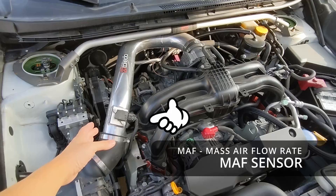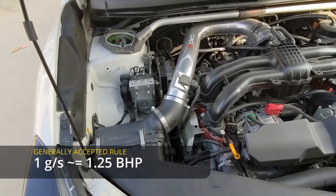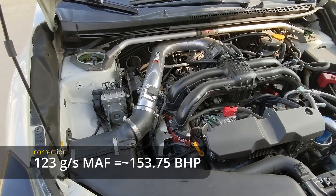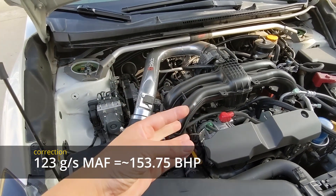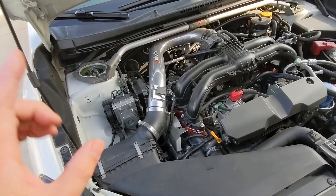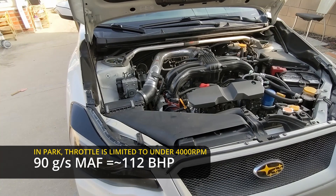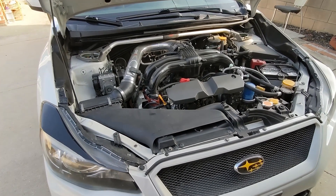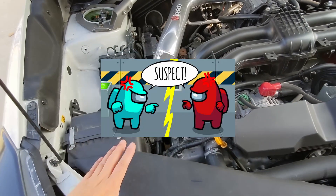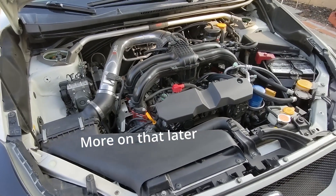For the longest time I've been recording a lot of MAF — mass airflow rate. What I found is that I can get up to around 122–123 grams per second, which has a potential of around 160 brake horsepower at the crank. What I noticed this afternoon when I went out for a drive was that during park, I pressed on the throttle and my MAF went up to like 90-something. I'm thinking, is there like a little air leak in here somewhere that lets in a hint of air before it seals itself up? I may be getting really good numbers because of that.